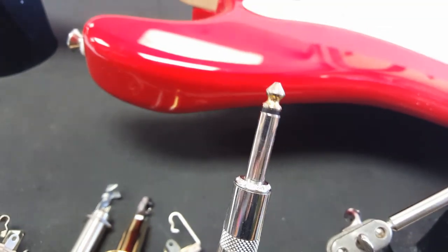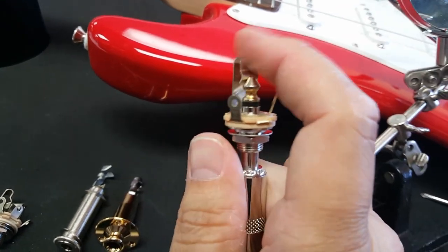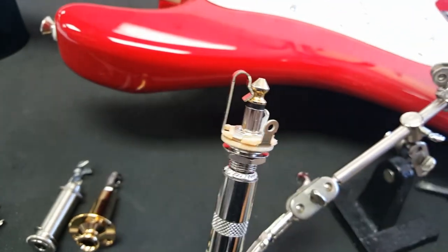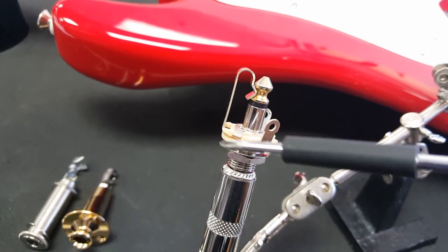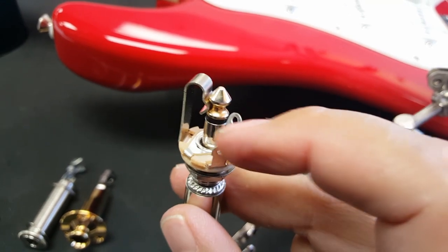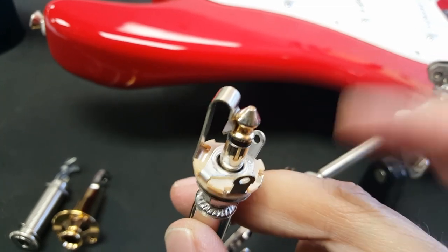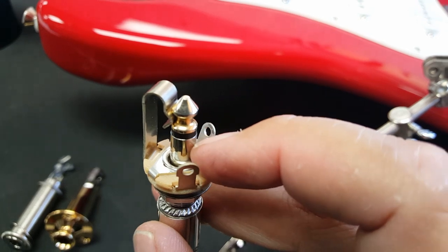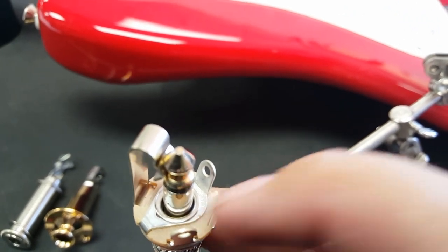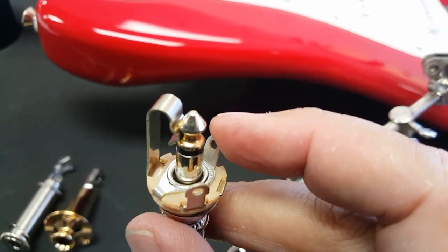Here is how it works. If we connect this guitar cable to the output jack on a guitar, notice how that works. Essentially, this tang touches the tip, which is going to be the output. So you would follow that to this tang right here and solder your hot wire there — this wire goes to the tip, and that's what you want for the output. Now the shaft, or sleeve, will have the ground attached to it, touching this piece right here. So on all output jacks: the sleeve goes to the ground, the tip goes to the hot. That's a pretty easy way to figure it out.